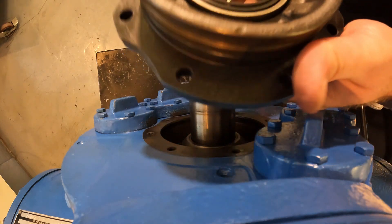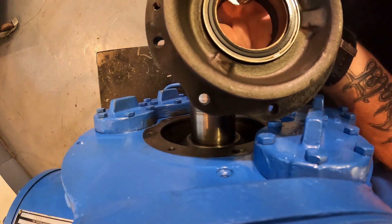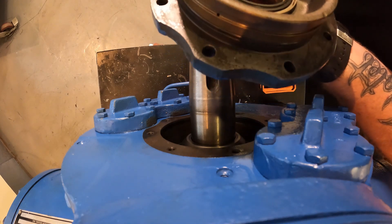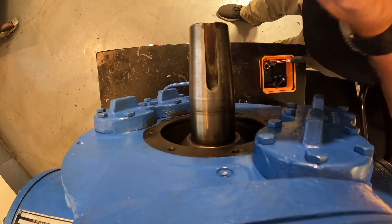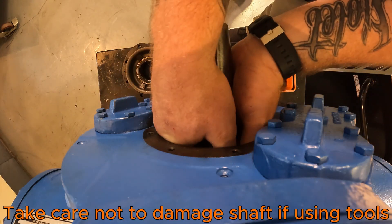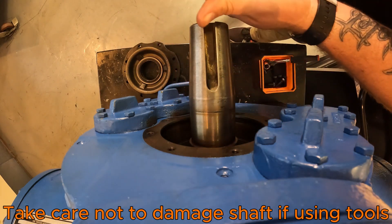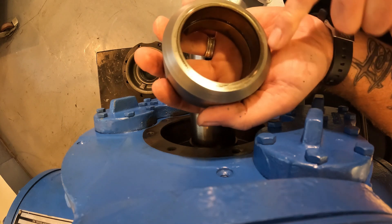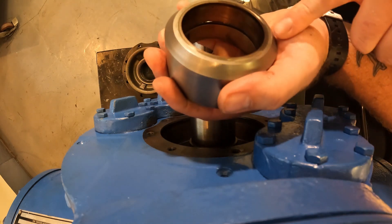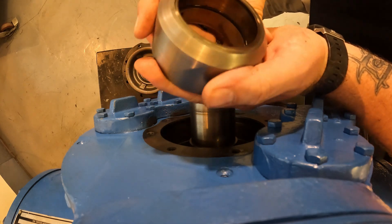Then you'll pull your seal off and do a quick examination of the interface to determine why the seal failed. You're going to look for any chipping, cracking, heavy carbon deposits, other deposits inside, and discoloration — which is a sign of heat. Once you have your outer seat off, reach inside and grab your inner rotating seat, pull it off and have a look around the face as well. You'll sometimes get hues of color indicating high heat, or rings and scratches from high debris content or buildup of different materials scratching the surface.